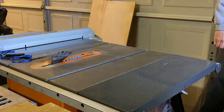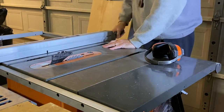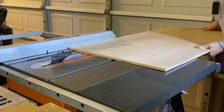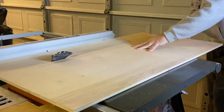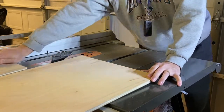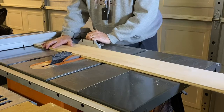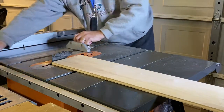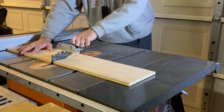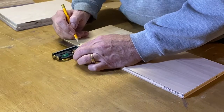Next was to get the drawers going. I'm setting up the table saw here and I'm going to make those out of some half-inch birch plywood, just cutting out the boxes. As I get ready to make the other pieces, I'm basically using the simple miter gauge that came with the saw — it's a Ridgid saw, works great, fairly new saw actually. I haven't made a cross-cut sled yet but I'll be doing that soon. For now, this is working well.